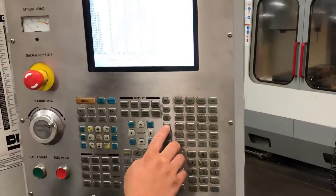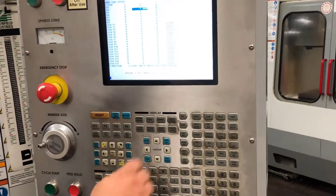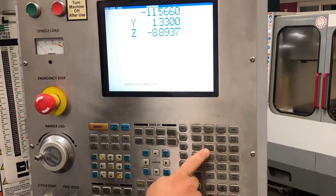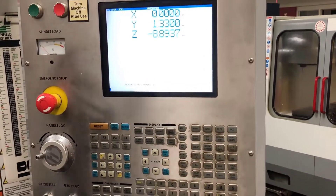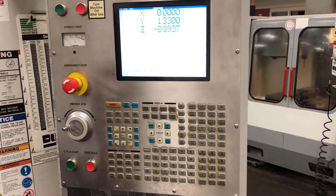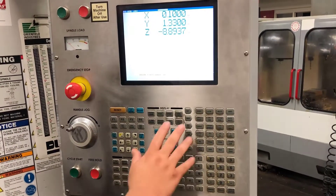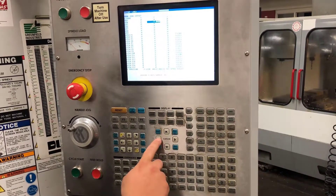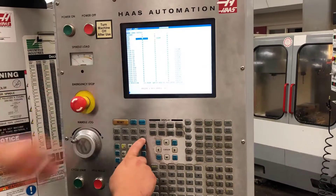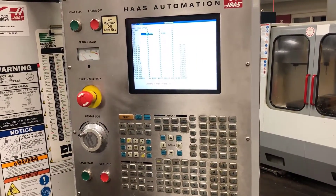Now that I have found my edge, I need to go to the handle, change to the Z axis, and speed up a little so I can come up off of it. I want to go back to my position page and origin my X axis so my machine knows I am at X origin. Now I know that the side of my edge finder is aligned with the side of my part, but I have to come over half the diameter of the edge finder, which is one hundred thousandths. So I'm going to be in my X axis and come over to one hundred thousandths. I will come back to my work offsets page, highlight the X axis, hit the part zero set button, and it will put my X position in — eleven inches, four hundred and sixty-six thousandths from my machine home.